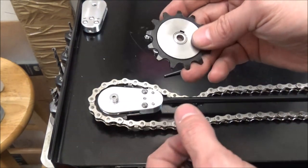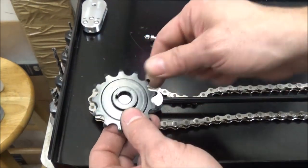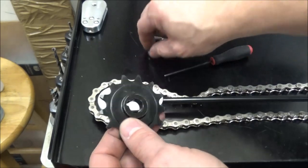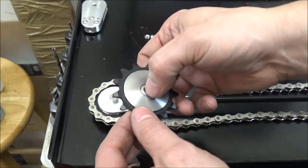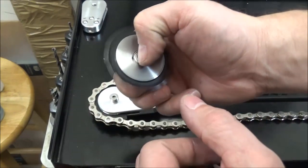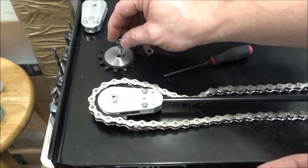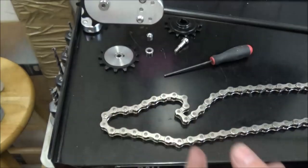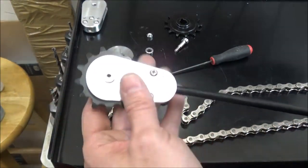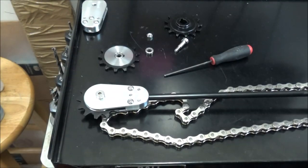I found these sprockets on eBay, and so I had to bore out the hub here to fit my bearing. And then I also had to turn this off to make it thinner and then just press the bearing in there. So that's basically it. I've got a shoulder bolt going through there and a nut on the back side. So that wraps up the air spring mounting bracket for the sprocket here. And in the next video we're going to work on our chain bracket.